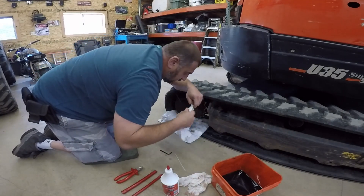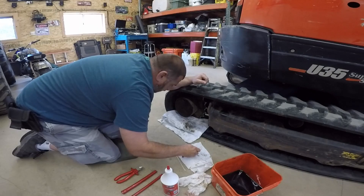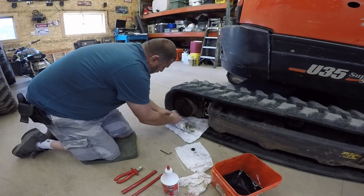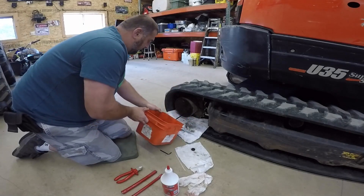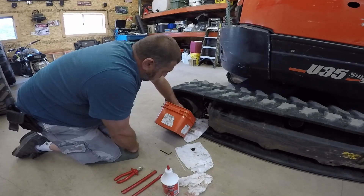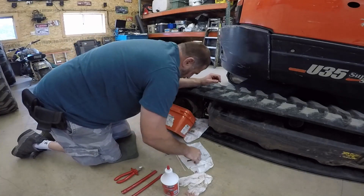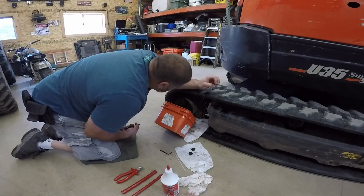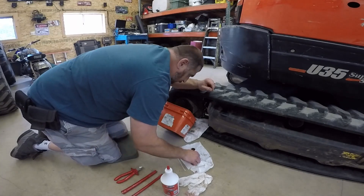Keep this out of the dirt. They're pretty straightforward and don't hold much oil. Got a little bucket here. There are three holes in this unit — the bottom one's the drain, it's even marked on the final drive. The center one's the oil level, also marked on the unit.